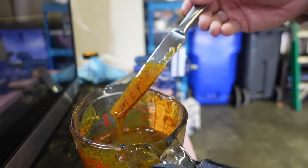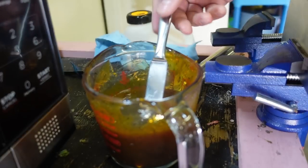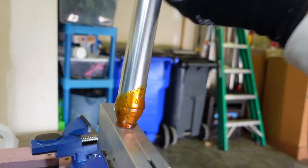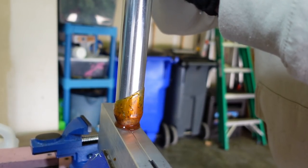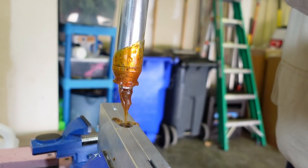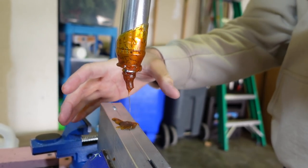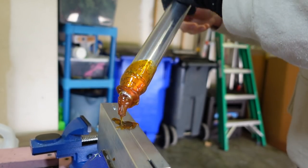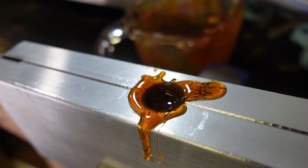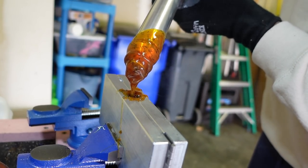A good way to tell what it'll look like is to put some on your knife — just a thin coat. We're at 357, so we're good to go. Grab some of this motor oil goodness, hold pressure down just a little bit, make sure everything filled in, then top off the sprue. As this continues to cool, the cold metal pulls the plastic in — you can see it sucking all the way down. Just make sure you top it off.